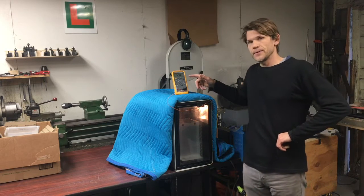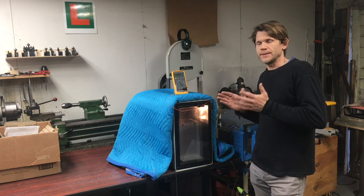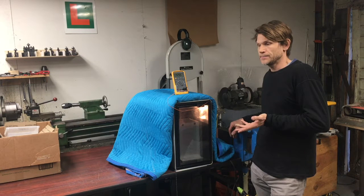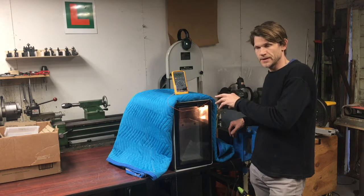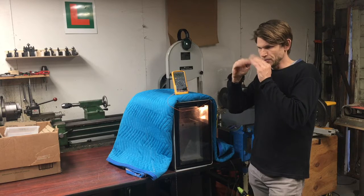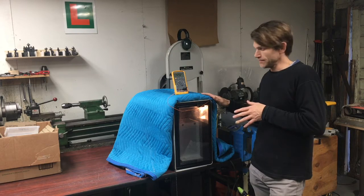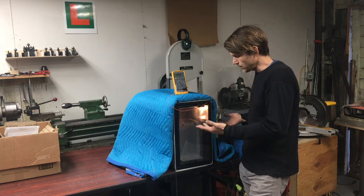Right now I've got it at 420 degrees. It seems that some acrylics melt at different temperatures — some melt at lower temperatures than others, extruded versus cast. I found that some will boil at around 390 degrees and some won't. I did a test earlier today and at 390 degrees the acrylic wasn't boiling — after cooking for an hour I was able to push into it and they moved around, but there were no visible air bubbles. I've had it at 420 for maybe half an hour, this whole thing's been on for probably an hour and a half. I've got a little packing blanket cozy over it — it may not be necessary, I just figured it might accelerate the heating up process.